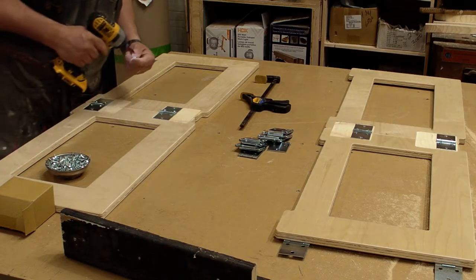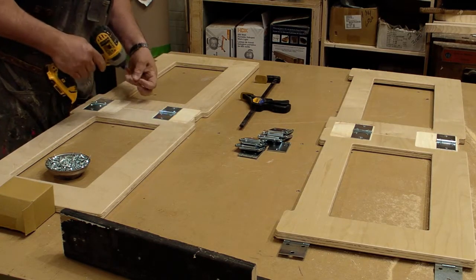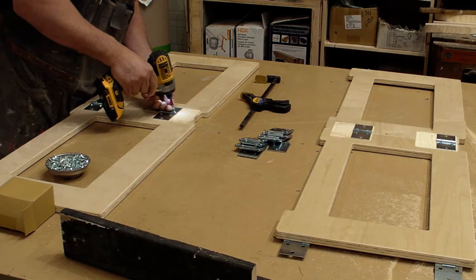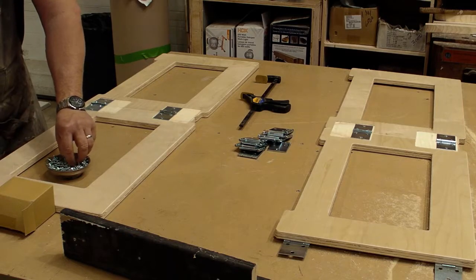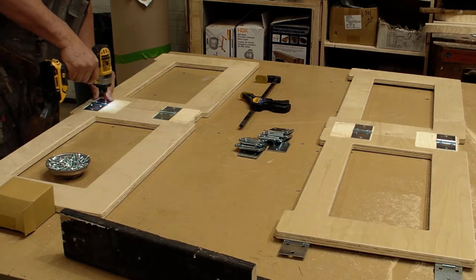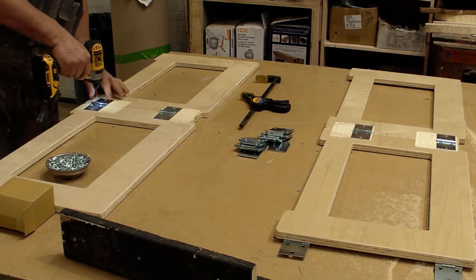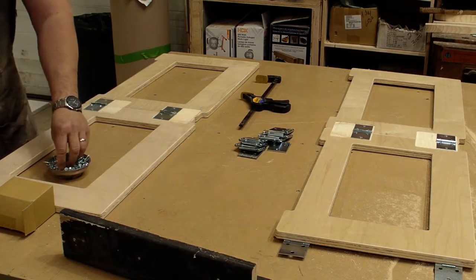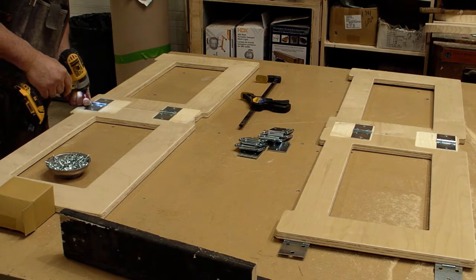So then I just put the rest of the screws in. If you're using a three-quarter inch screw that doesn't have an aggressive thread with a good point — one well designed for this purpose — then it is a bit of a pain and the screws may dance around a bit. Then you might have to pre-drill or use a VIX bit or something like that.